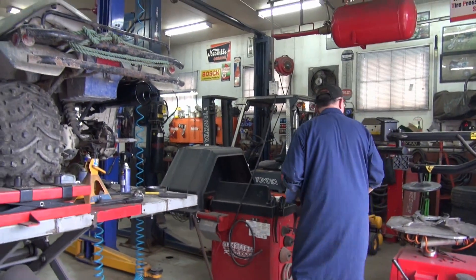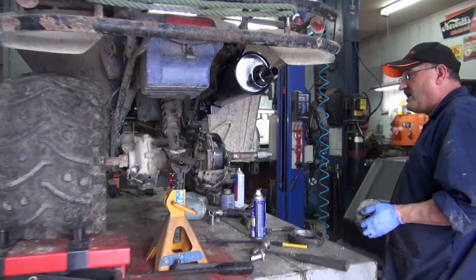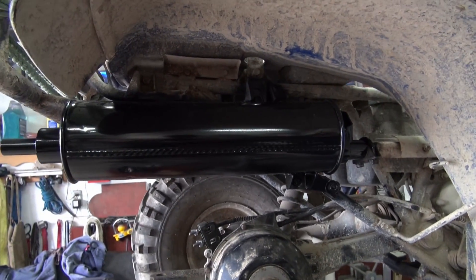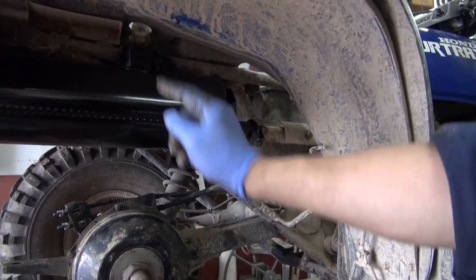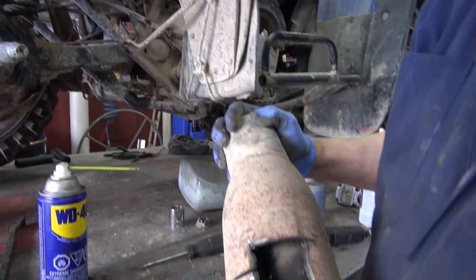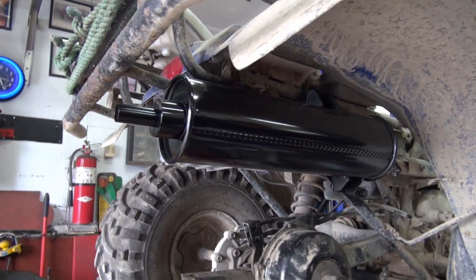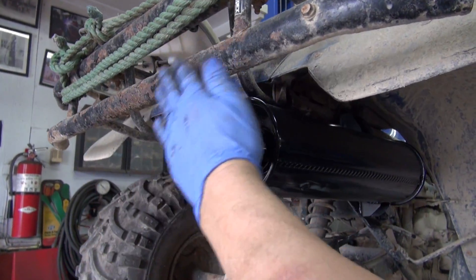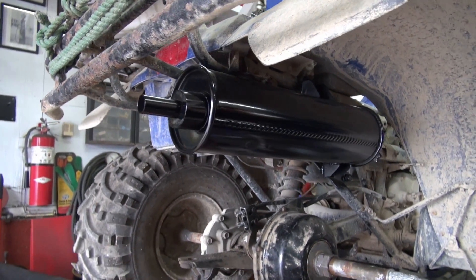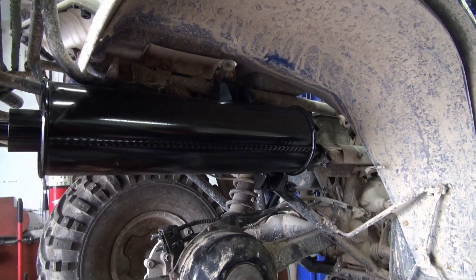So we got a car muffler. Have a look, Sean - that looks much better. I made adapters and took the original bracket from up top, cut it off, and welded it onto the muffler. Then I machined a couple of inserts and a little tailpipe. The tailpipe doesn't protrude farther than the bar, so they can't hook into it when walking by. It's bolted from here to here and here - adapter made, all very nice.